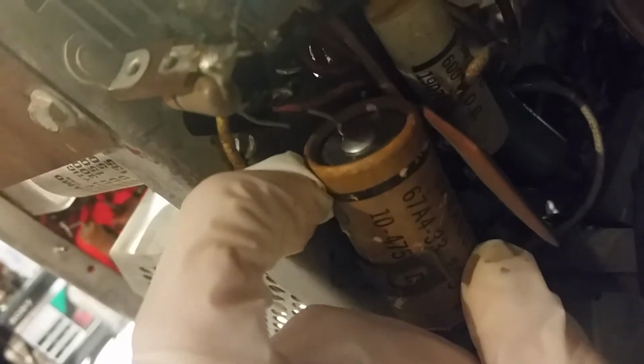So I'm putting this thing down, and look, there's a clipped out capacitor right here. Somebody clipped it out. Huh. And it goes to one of the electrolytic capacitors, and it's on the side of the bad selenium rectifier where it doesn't measure any voltage. I think this is the problem. Somebody clipped this out. What is it though? I should unplug this. What is this? I guess. Got that capacitor connected back in circuit. Let's see what it does.